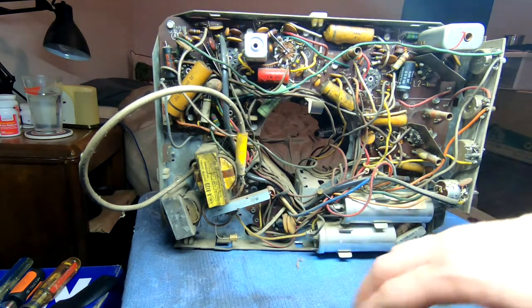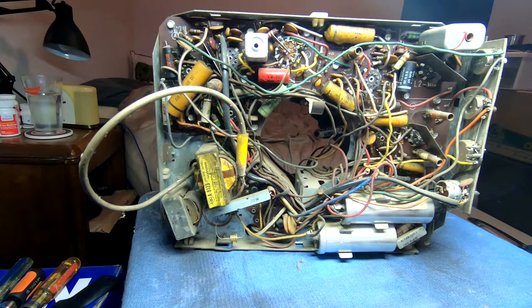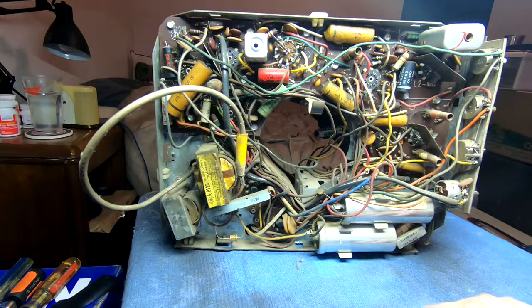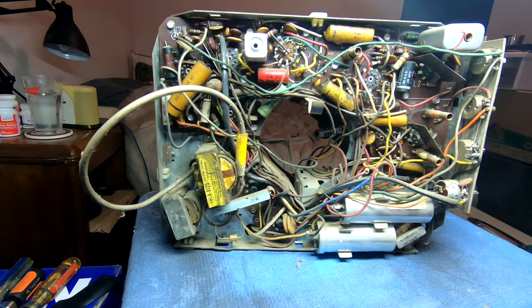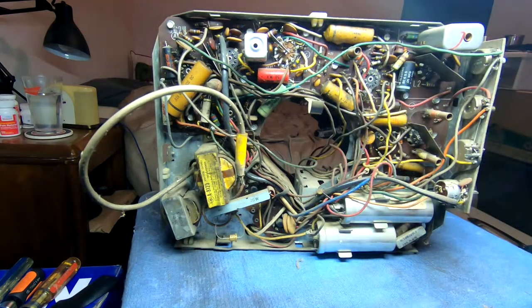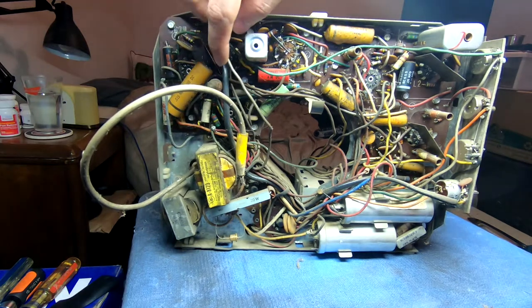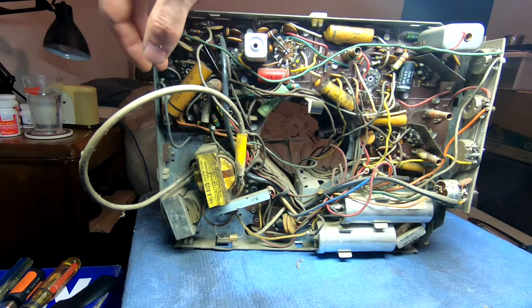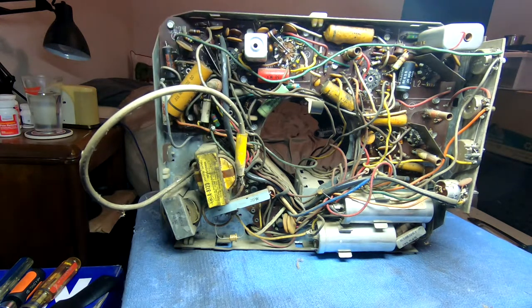I did notice in the cabinet there's actually the end flap from a Miller Electronics box for a 4.5 megacycle coil. So I'm guessing either the video or audio IFs got replaced. And there are some wax caps. So got one tucked under here. That guy, that guy, that guy. Ooh, that one's rated at 1600 volts. I don't have any like that. I don't do television work very often, but I've got my little RCA oscilloscope, it's going to need one or two of these too, so I'll have to put together an order on Mouser and get those in.